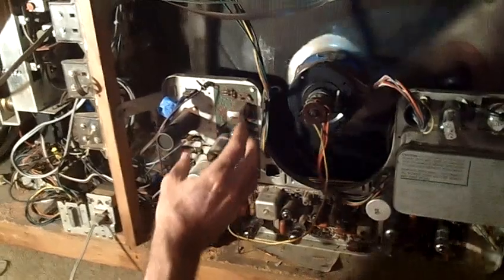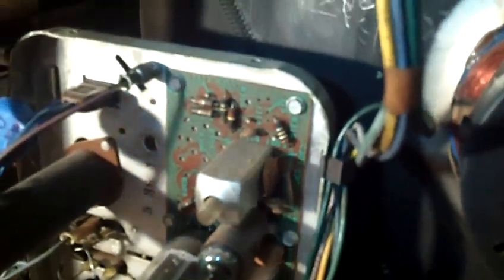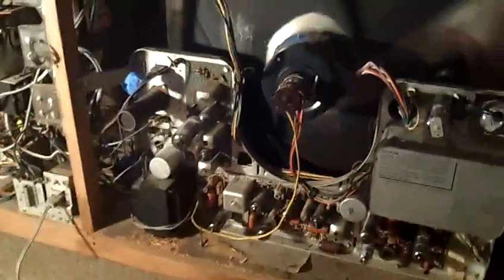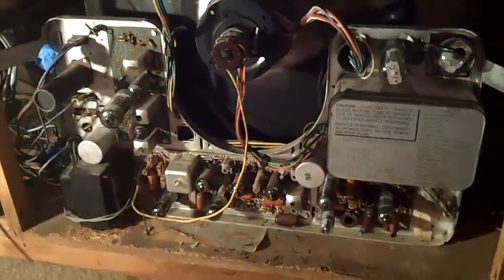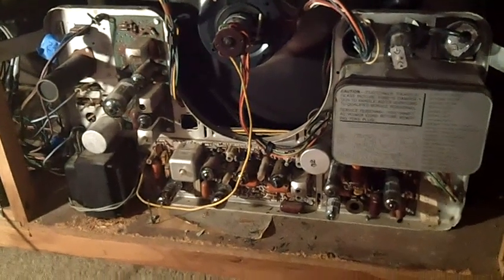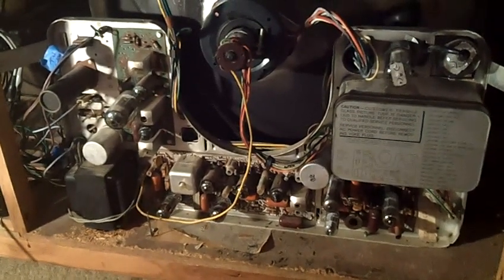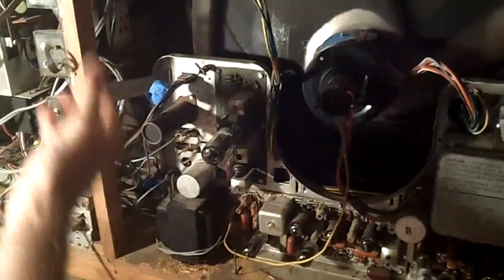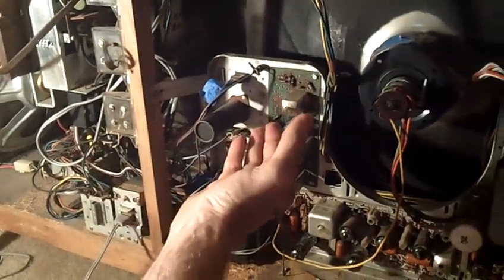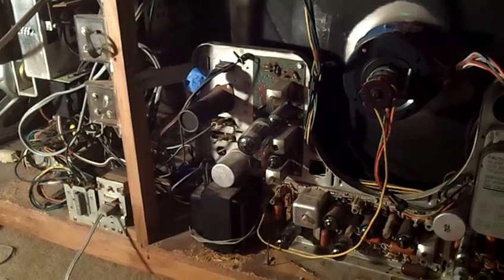This board is actually the audio, but it's missing a tube that would go right here. The reason it's missing a tube is because being a combo, it has a separate audio amp for the TV sound. Magnavox rightfully used the quality stereo amplifier for TV sound as well as the phonograph and AM — in contrast to how RCA and Zenith did it, where they would just switch the speakers from the stereo to the TV amp and back again. Why not use that high-quality amplifier for the TV sound? This makes a whole lot more sense.